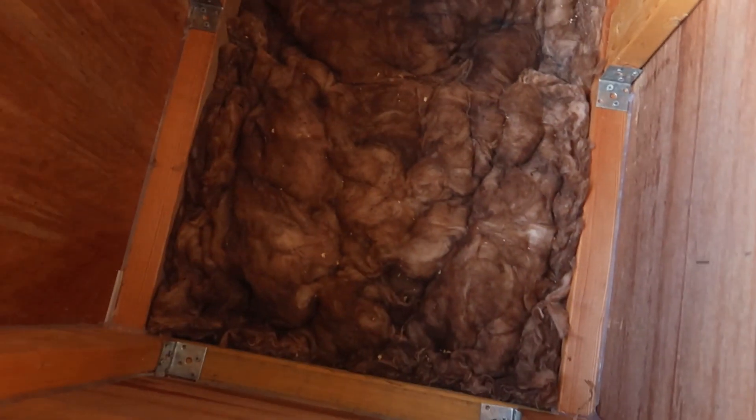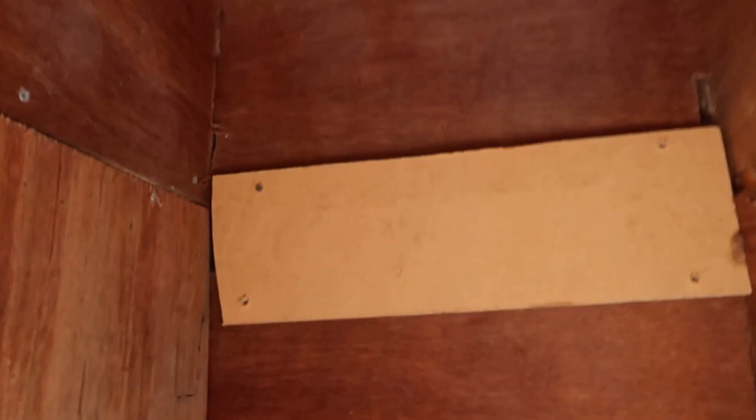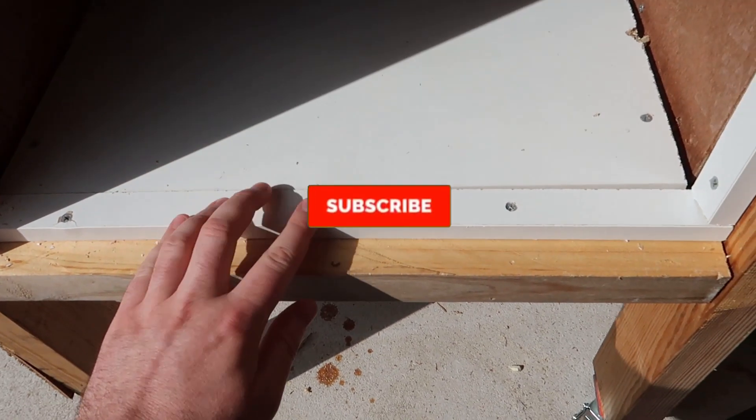Now on the inside, what we're going to do is put some insulation on the inside layer of the actual box. I've done that on all the sides and then I've put more of that sheeting up, which will insulate the inside of the box. The reason I want to make sure to do that is so that during the hot weather season, we don't get the heat coming in as much into where the sensors are. And during the winter at night, the cold air doesn't make condensation on the inside and cause any issues with the sensors or the equipment inside. So it's built in a way to help either way.